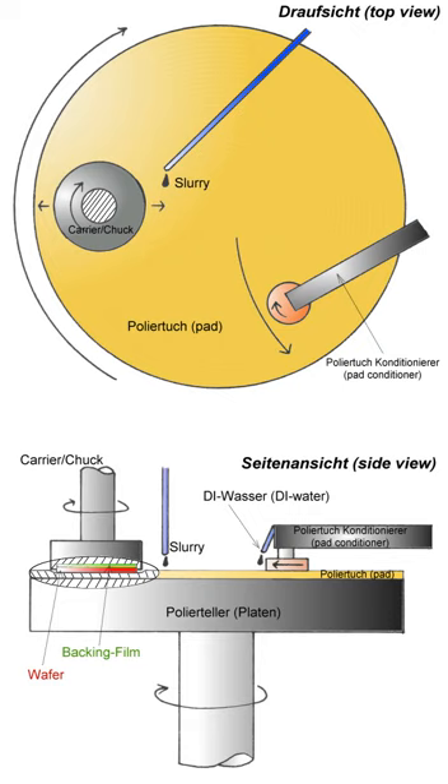This process comes in a sequence pattern as follows. First, the isolation trench pattern is transferred to the silicon wafer. Oxide is deposited on the wafer in the shape of trenches. A photo mask, composed of silicon nitride, is patterned on the top of this sacrificial oxide. A second layer is added to the wafer to create a planar surface. After that, the silicon is thermally oxidized, so the oxide grows in regions where there is no silicon nitride and the growth is between 0.5 and 1.0 µm thick. Since the oxidizing species such as water or oxygen are unable to diffuse through the mask, the nitride prevents the oxidation.